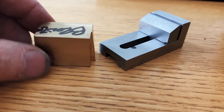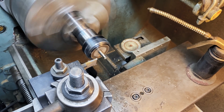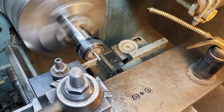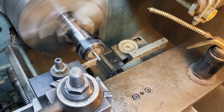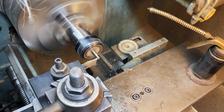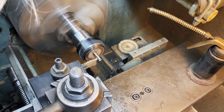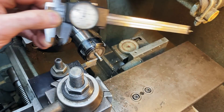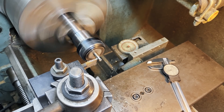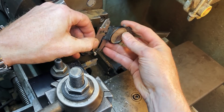This is a chunk of bronze that I salvaged out of a boat that Jamie and I blew up — it will come in later. This right here is the thread for the driver for the live jaw of the vise. Most vises use a threaded rod of some kind — Acme threads. But this is just a normal three-eighths inch stainless steel bolt that I'm turning down the end of so that I can capture that end in the live jaw of the vise.